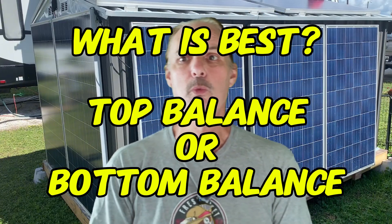Which is better — top balancing or bottom balancing? In solar systems, everyone uses top balancing because it's easy to get there. Most BMSs today have some kind of active or passive balancer. For example, EG4 LifePower4 batteries have a passive balancer, while a JK BMS in a DIY battery may have a two-amp active balancer. Depending on your equipment, you'll likely have some kind of balancer available, so you'll want to bring that voltage up and maintain it.